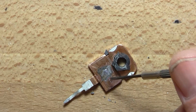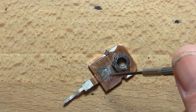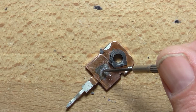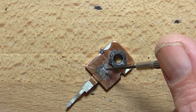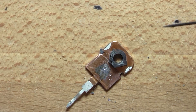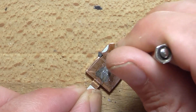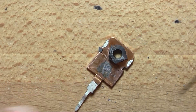I don't have the internal diagram of what a genuine transistor of this type — the TIP35C — should look like, but I can hazard a guess and guarantee that this die should be at least twice the size. That looks like a small signal transistor die rather than a power transistor die to me. I've not really seen inside fake transistors before, or inside real transistors, because there's no point taking one apart. But yeah, that would be what the issue was. That's all burnt crap.